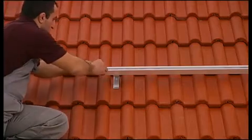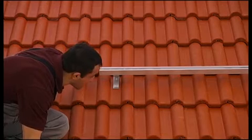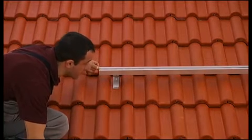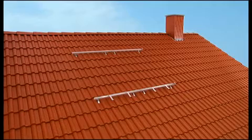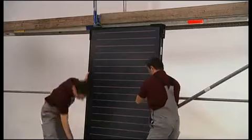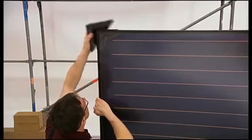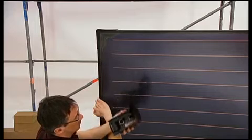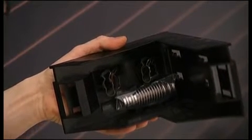Please check the rails for possible sagging; you may use your measuring string and pad them if necessary. No cross rails are required. Now you can mount the collectors — they're easy to handle and can simply be put down on their edges, as that's what they were designed for. You'll find all the connection parts laid out between the collectors inside the protective casings.